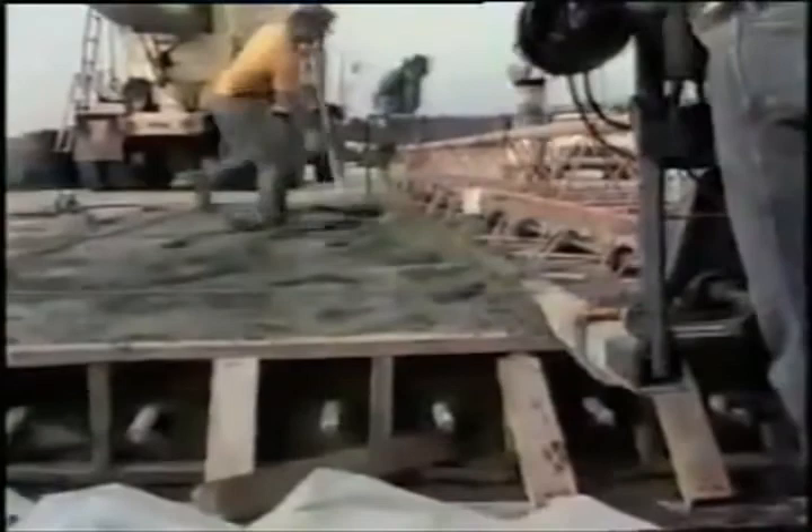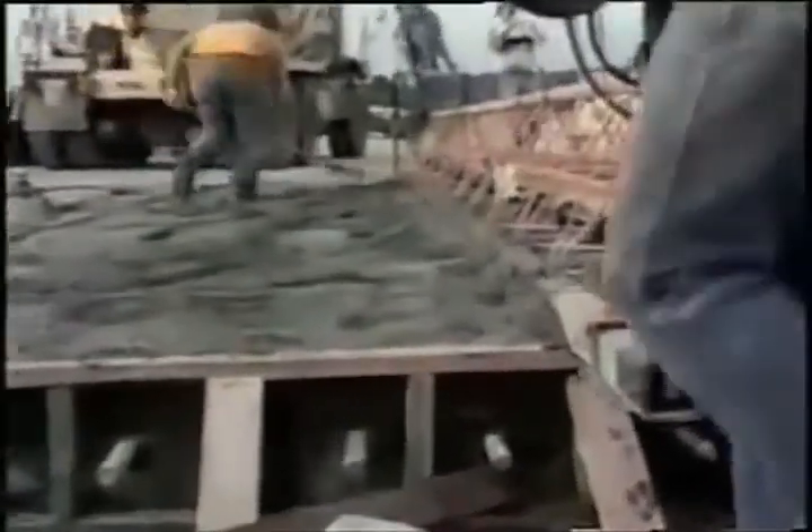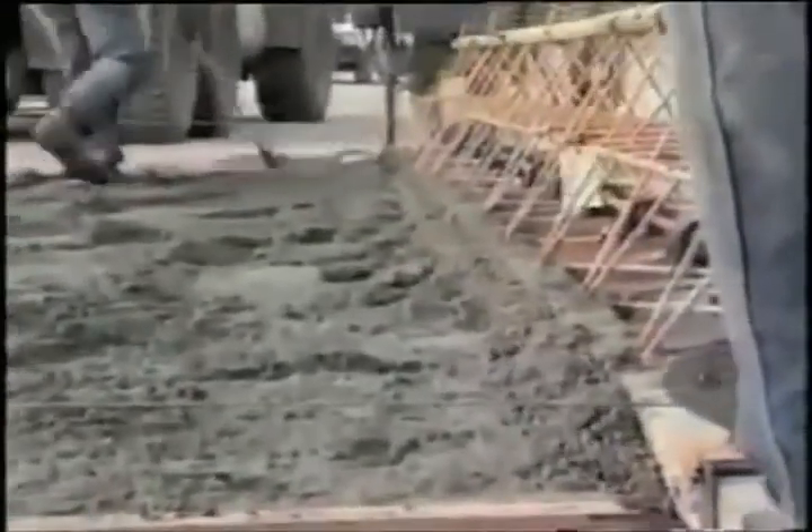An additional advantage of aluminum tubes is the ability to move and carry a roll of concrete ahead of both the front and rear tubes during finishing operations. The rolling action created by the tubes helps prevent voids and greatly reduces the amount of labor needed to level concrete ahead of the machine.